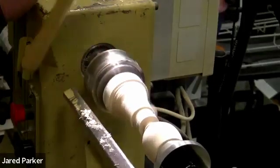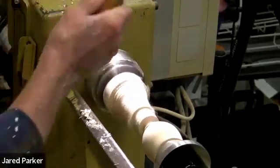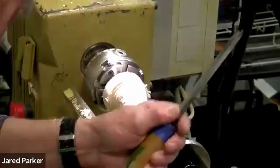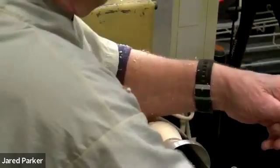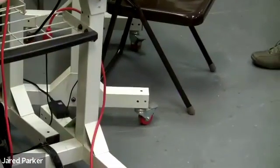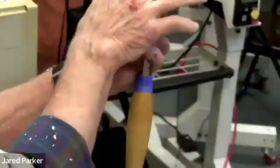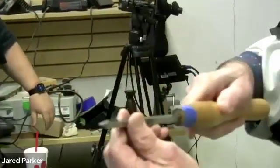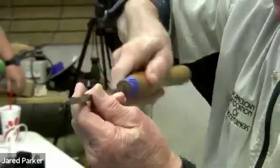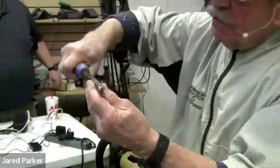Okay, I brought the 1/4 inch. This is for doing a 1/4 inch. You've got a half, 3/8. There's several different things. Like I said, this is the easiest tool to learn how to use right here. You basically sharpen this tool by going both ways on there, and then you present the tool straight in and tip it up so the cutting edge will work. And that's how you actually smooth it.